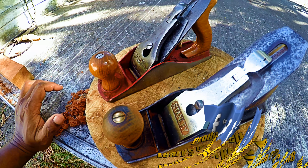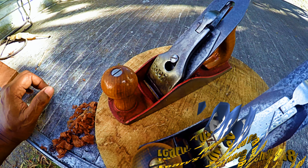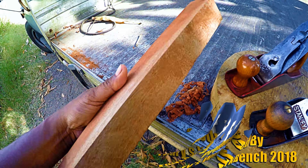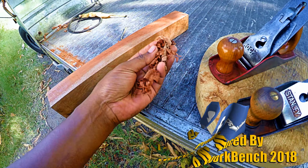It's not an easy task restoring these old Stanleys, especially the sole plate, which required a few hours of lapping on a plate to get it flat using 100 grit aluminium oxide paper. The other plane is based on a Stanley number four but has 'Record' written on the lever cap. Unlike my dad's Stanley, this one doesn't have a frog adjustment — it's just a manual adjustment, no screw.